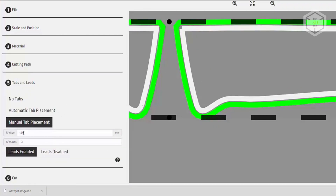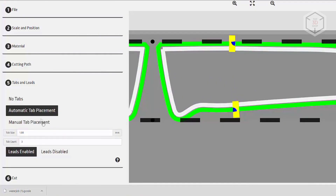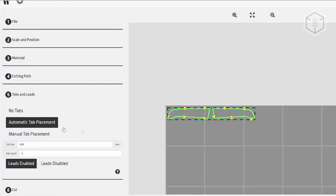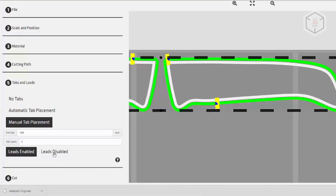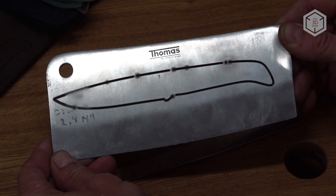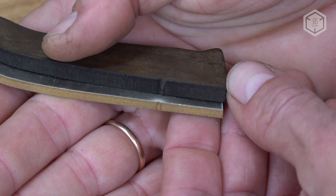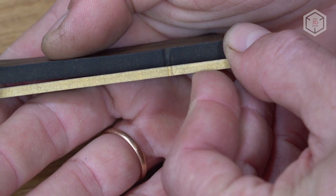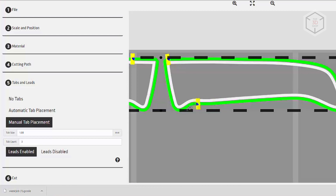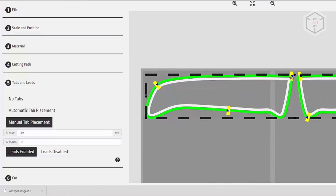For particularly thin, soft, and delicate materials, gaps are strongly recommended, as the part may be exposed to the abrasive water jet when it separates from the workpiece. The software allows you to set the length and number of gaps, as well as automatically arrange them — they are highlighted with yellow dashes. You can also enable or disable leads, indicated with blue triangles. Pierce points have a larger diameter than the width of the cut and give a notch on the edge, but make cutting more sustainable with better process control. When leads are turned off, the piercing occurs smoothly and the contour is more even. In our test cuts, we ignored the manual settings and left everything as it was.